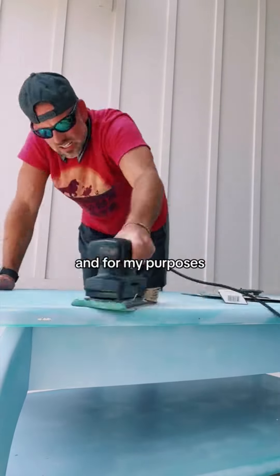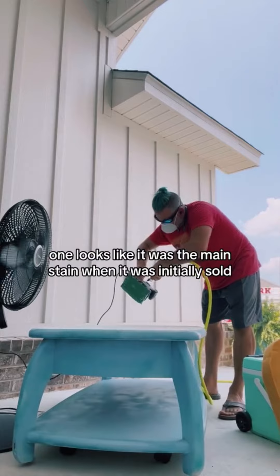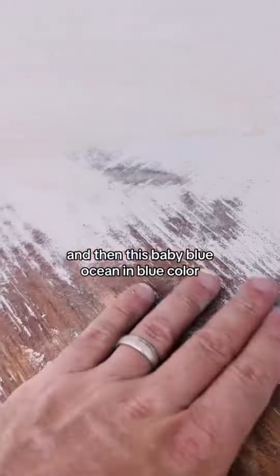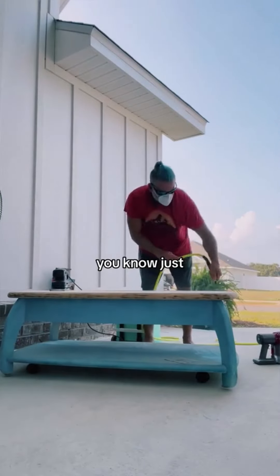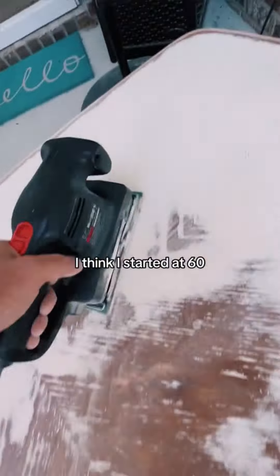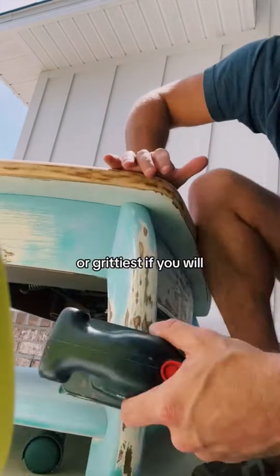I'm super excited that they worked, and for my purposes I didn't need them to work too good. I started sanding and realized there were several layers of different colored paints — one looks like it was the main stain when it was initially sold, then two colors of white, and then this baby blue ocean blue color. There was tons of tedious sanding. I probably could have gotten a rougher grit — I started at 60, then 80, then 100, then went up to 220.